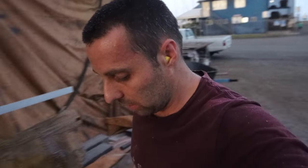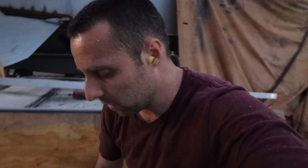There's going to be some people out there that are probably going to have a problem with that, and yep, dry blasting is probably the best way of doing it, and then putting a real solid zinc rich epoxy onto it. But if you don't have the ability to dry blast, wet blasting is the next best thing, because nothing else has got enough key to actually hold the paint. Wet blasting roughs up the surface enough so you get a real good bond.